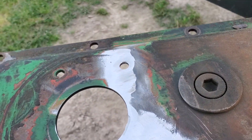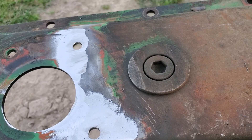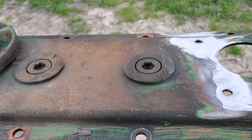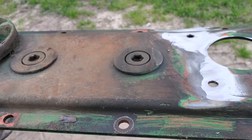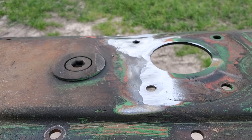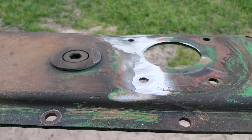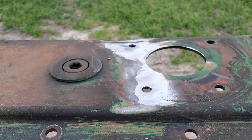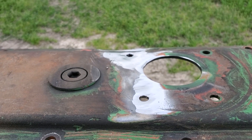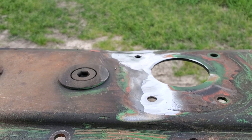So that's how you fix a crack in a casing on something that's kind of sensitive. Like I said, I didn't want to just blow straight through this because of that sprocket on the bottom. So I hope this helps y'all out down the line. Now this is not the same thing as welding up an open joint for complete joint penetration at all, by any stretch of the imagination. But it will get you through repairing cracks in equipment. If you're not that confident in your welding capabilities, don't worry — something like this is relatively easy. Keep your amps low but take your time. That way you make sure that you fill it all the way in and you don't leave any undercut or any gaps. Had this not had that sprocket on the bottom, I probably would have went ahead and burned straight through it, but I didn't want to do that.